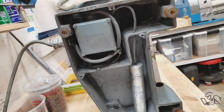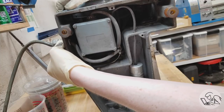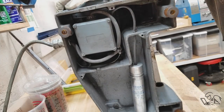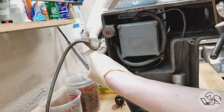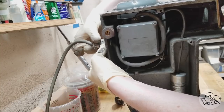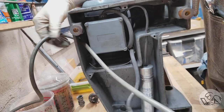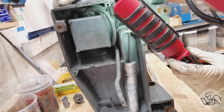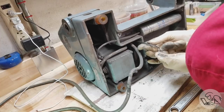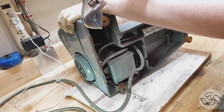The main body has two castings and I want to separate them, but the motor capacitor and the main power cord are mounted to the lower casting while running through or attached to the upper casting. So I'll start by removing the power cord — I take this very important safety cardboard off, unscrew these terminals, and the plug comes off. Then I undo the strain relief, which I don't think is factory — it's plastic and in pretty bad shape. Now I can fish the power cord through, because it's attached to the switch and motor which are both in the upper casting. Looking from the bottom, there are some big cap screws and possibly some small nuts holding it together. We'll get those big cap screws out — they are Loctited in place, so they're a little stiff.